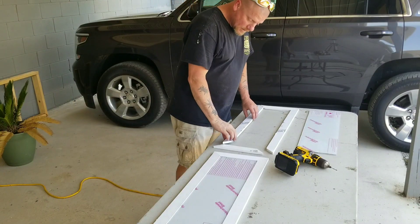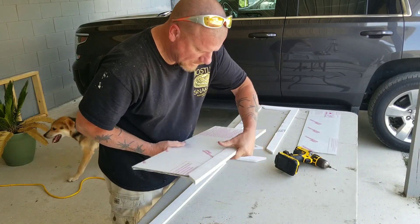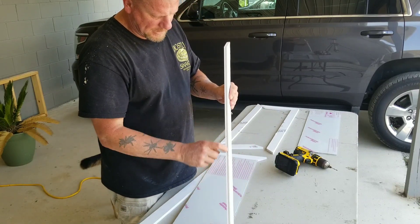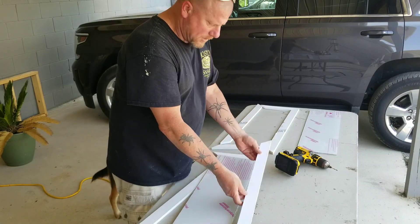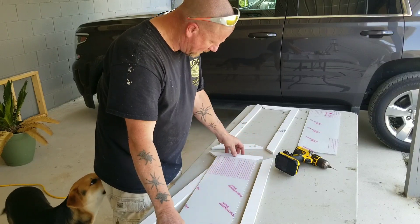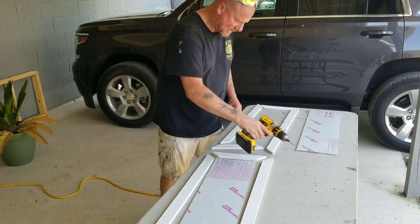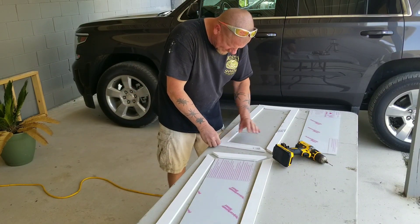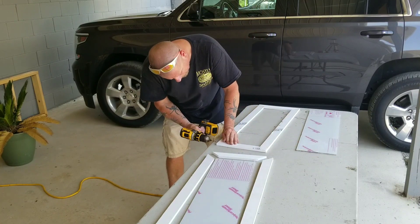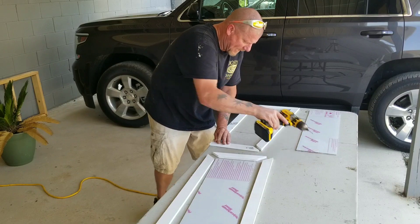Okay, we had to move into the shade. What I've got here is the layout for the drop-down doors. The way I did this is I cut one-and-a-half-inch strips and beveled out the inside to accommodate the polycarbonate. You cut your 45s, get your measurement for the long side on the inside of the door, cut your 45s, and get it all laid out. Now we can start the assembly — you're going to need two drills to make it less of a pain. Line these up, and for this I do recommend a pilot hole.